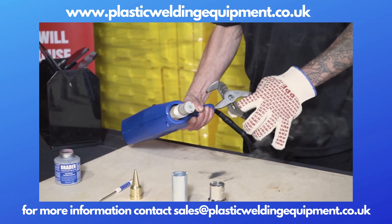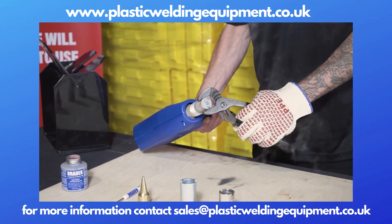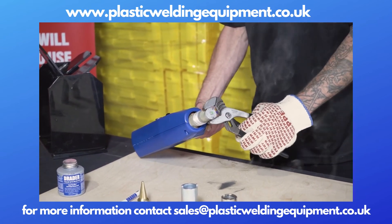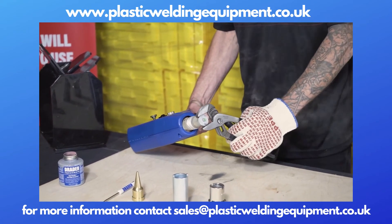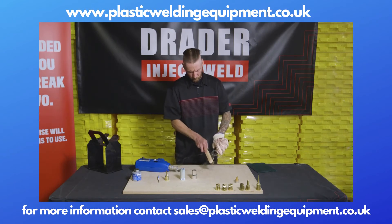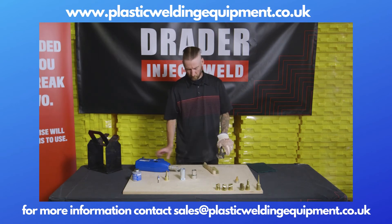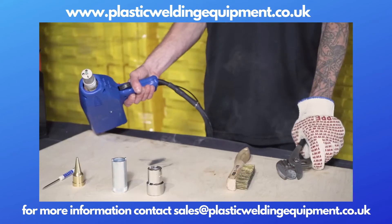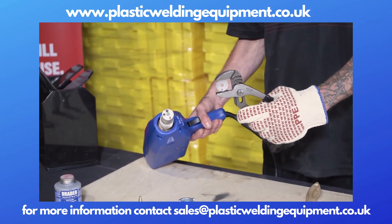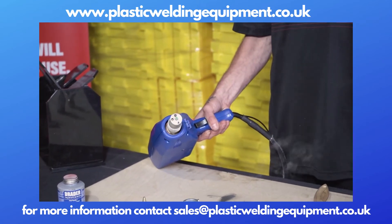What's important about the barrel washer is it has a little locating pin, and we want to make sure that locating pin is always present during a tip change. On the end of the barrel there's also a locating pin, and that locating pin matches up with the hole in the barrel washer — so it's very critical that it gets matched up each time.